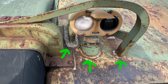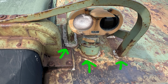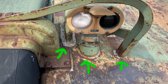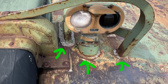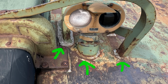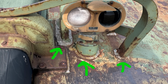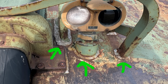Now again, you still see them doing the big gangster weaves, but well, it's more or less a horizontal stringer, and that actually appears to be wire welded and not stick welded. And wire welding, by the time that this tank was produced, did exist. Not only did it exist, the wire with higher nickel or higher chromium would have easily existed at the time, so they could have simply constructed that weld with a more modern welder, aka a wire welding machine.